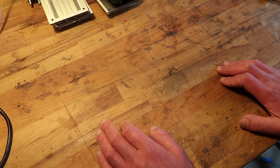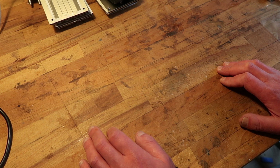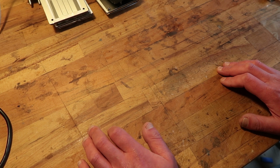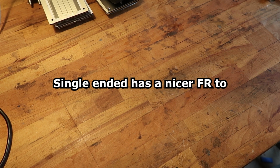So what I'm going to do, I'm just going to make the tweeter I wanted to make, or did make, but I changed some stuff. It's going to be single-ended instead of push-pull. Why? Well, I'm making a tweeter for a driver that is not very efficient. It's a monitor. I mean, you cannot expect it to go down to 50 Hertz or something, while it is a 5-inch driver and have a lot of output. So there is no need for a very efficient tweeter. The only thing I decided is it's going to be a rather biggish tweeter, because if they're bigger, the distortion goes down. Of course, also downsides, dispersion will not be as great as a small tweeter. But anyhow, that's what I wanted to make, and I'm going to remake the tweeter.